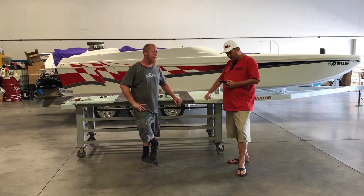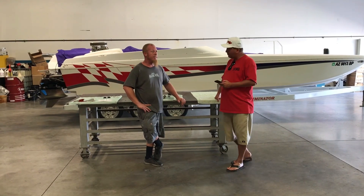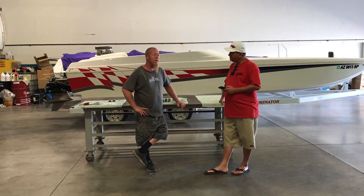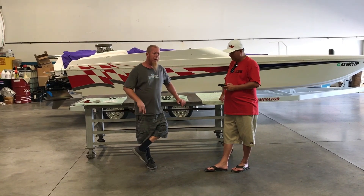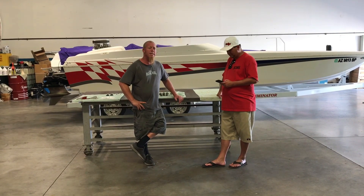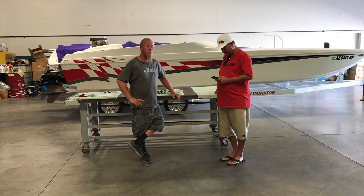From the same guy, Boatman: oil lubrication on an 800 horsepower drive — 10 hours, 15 hours, 20 hours? I'd say 10 to 15. I'd probably change it at 10 the first time and see what it looks like. The oil always doesn't look burnt, but the viscosity gets crushed down between the teeth and the gears, so it's good to get it out of there at 10 and see what it looks like. 15 tops, but I probably wouldn't go too much longer than that.